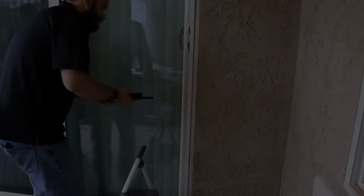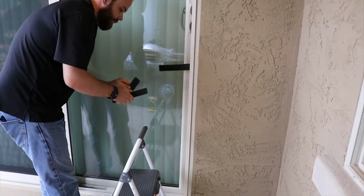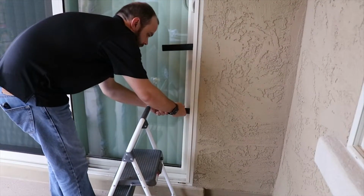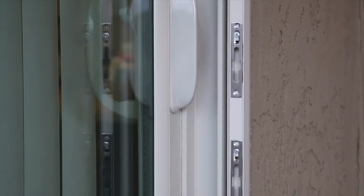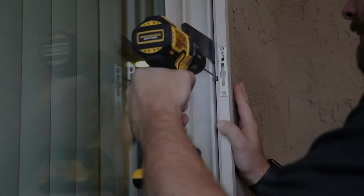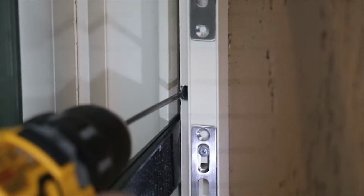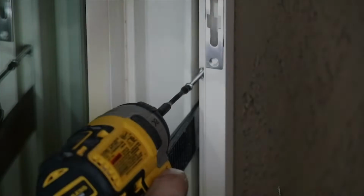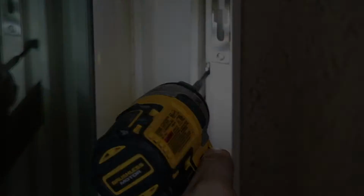If your patio door is equipped with a pocket that is wider than the latch side jam extender mounting leg, it may be necessary to cut and install shims on the side of the mounting leg above each mounting point to align the latching face of the extender with the door lock channel. Mark and drill holes used to mount the latch extender using a 1/8" drill bit and fasten it to the patio door frame using the number 6 2.5" panhead screws provided.